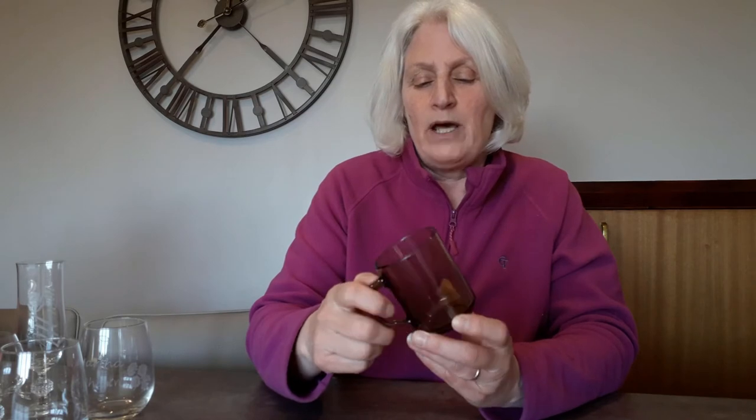There's a whole range of glass out there. If you were around in the 1970s you might recognize these mugs — they were everywhere then and obviously they last a long time. I wouldn't recommend engraving on this type of glass because that is toughened glass. A lot of people do engrave on toughened glass, and if you are very shallow in your engraving and don't cut deeply, it works fine. My worry is that if you cut too deeply, and particularly if the glass is then subjected to a sudden change in temperature, it could just shatter. Personally, I wouldn't be engraving on that type of glass.